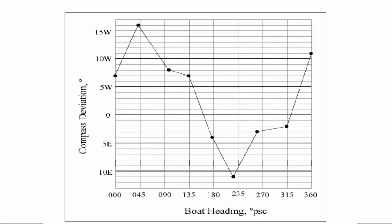But do you know its accuracy? Recently, one of our school boats came back from a cruise and the captain said, this compass is way out. How do you know that? Well, I'm going between these two buoys and the compass is nowhere near what the chart says for that course. So we went through a lot of evolutions on how to calibrate a ship's compass in a practical way and we swung that boat's compass, and here are the results. Notice that this deviation ranges from 16 west to 11 east. That's a huge error which would put any navigation that we're doing in jeopardy.